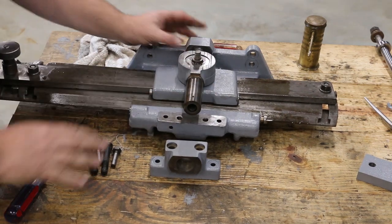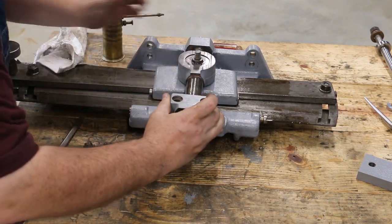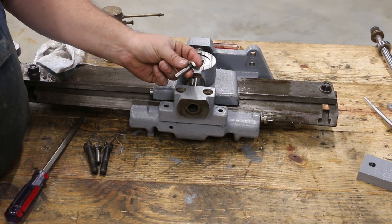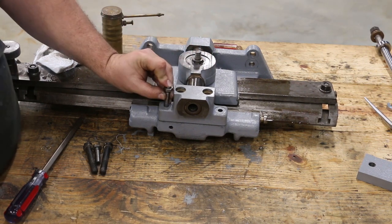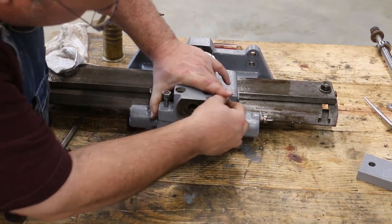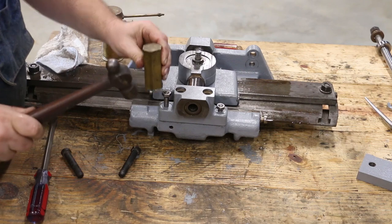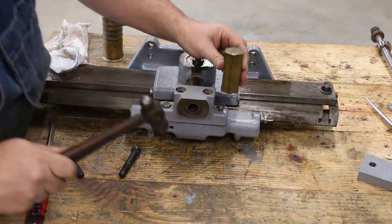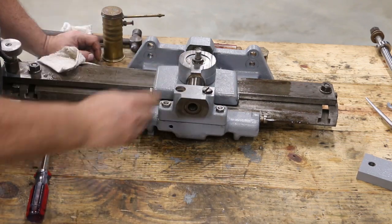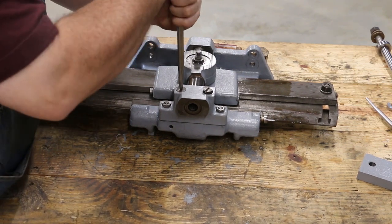The next piece to put on is this little block on the end. Before we do, we want to make sure we've got everything lubed up good — way oil, make sure this thing's all lubed up real good. So we slide that block over the end and the way this is mounted is unique — they actually have two alignment pins. There's one here and the two holes on either side. We go ahead and get those pins in first, then bolt it down, because we want to make sure it's aligned just right. I'll use my little piece of brass to make sure I'm not damaging any threads and just pop those in. Once the pins are in, we'll put the two screws that hold it in place and tighten those up.